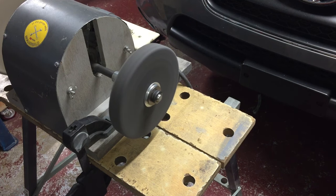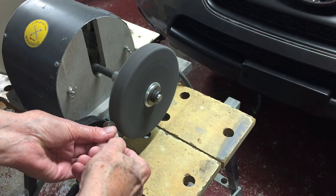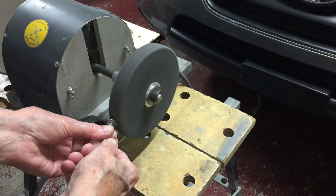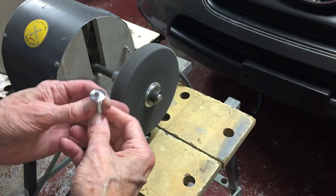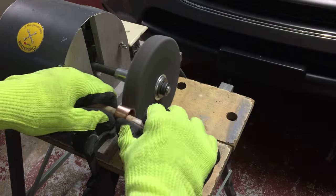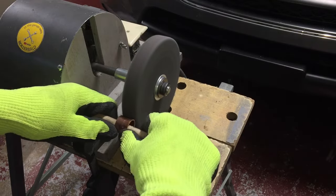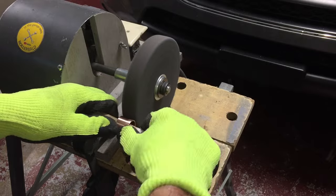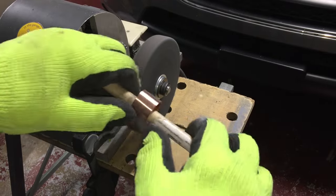This carriage bolt is going to be polished and epoxied into the butt end of the handle, mainly for decorative purposes. I'm going over the bolt and the ferrule with the fiber wheel. Too bad the butt cap and that ferrule couldn't be made from the same material, but I was just going with what I had on hand.